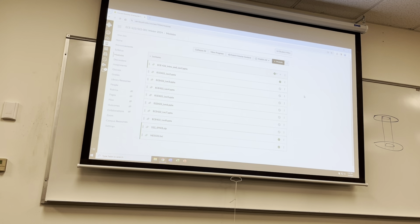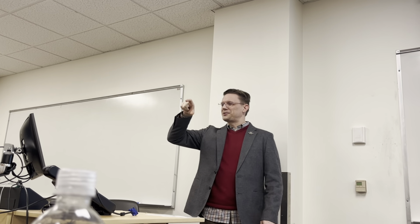It's actually two op amps. And that would be, the complementary symmetry output just works. Unless you connect something wrong or burn it out, that just works. The hard part is the op amp part. Because honestly, the diff amp we used was very, very simple. Because it's simple, it didn't have a lot of variability and you had to tune things just right. I burned out my PNPs and that's why mine wasn't working. I finally figured it out. And then thankfully, I remember because we only used two PNPs, I just took it out, flipped it upside down and used the other side and then it started working. I'm like, oh, I just burned them out.